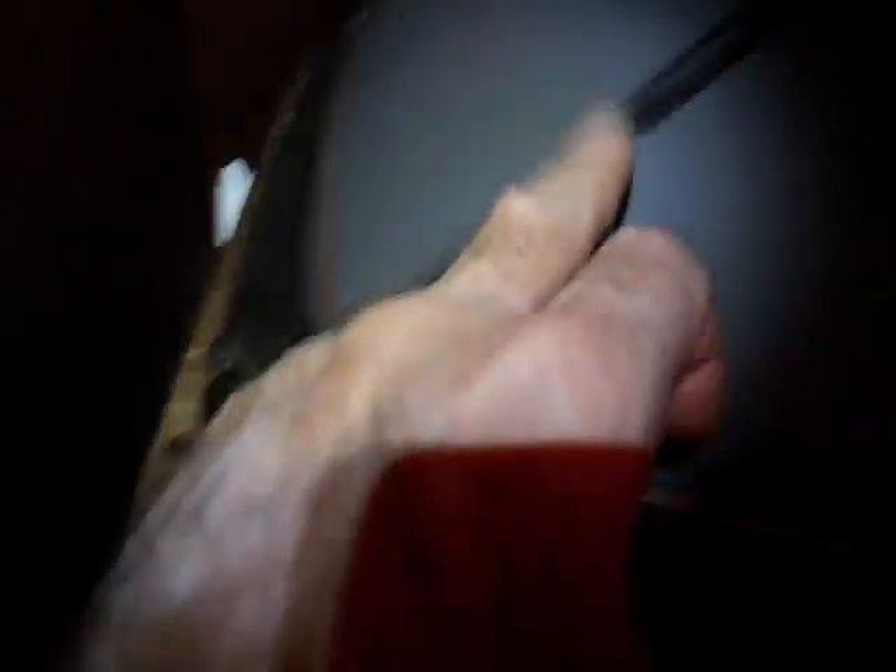I've removed the magnetic shield. Next, what we're going to do is undo these springs down here. There, there, there — note that this screw is up on the top. I think that should let me release this yoke, although I think it uses double-sided sticky tape to help center it up, so I'll probably have to fight with that.